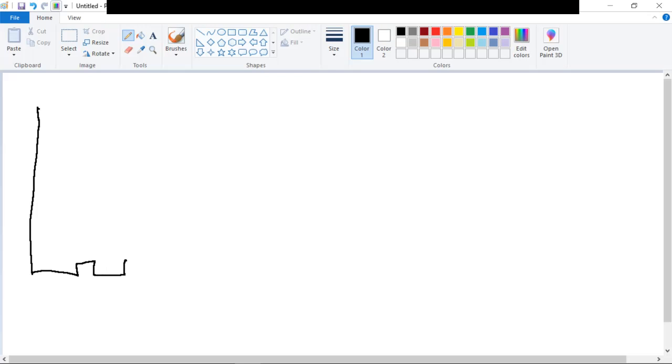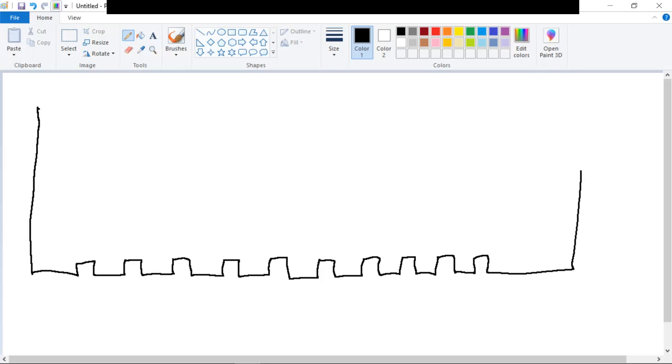Yeah. Dip pole. We'll go back to here and put an open point. If I pull off any elbow, A or B, in the first one, no power to the entire line. That's what you're saying, right? Yes, sir. Once you break primary feed in any transformer, everything beyond is de-energized.